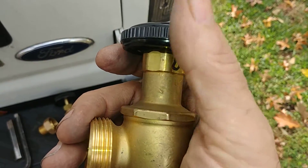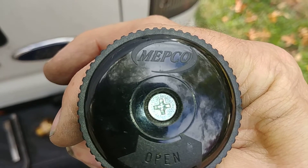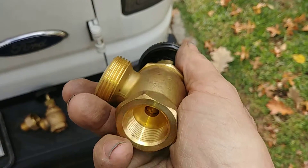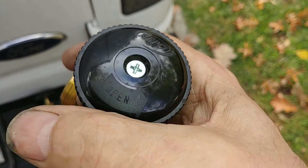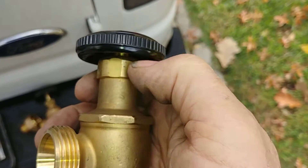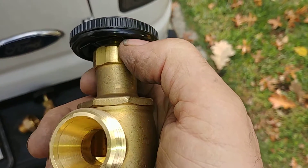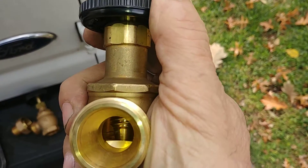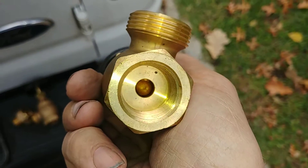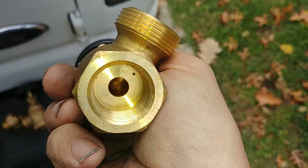The other kind of hidden feature is that if you take off that screw for the cap — and you can see this is a Mepco example, which is the successor to Dunham Bush — you reach way down inside the stem and there is a set screw, a bladed set screw, just a regular slotted set screw. You need one of those little mini screwdrivers, and you can set this so that it can only open so far and then stop. So there's an internal stop which is adjustable, to reduce the likelihood of this thing being open full port and overwhelming the radiator and sending steam into the dry return.